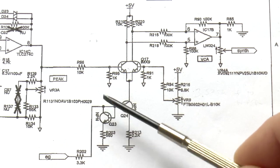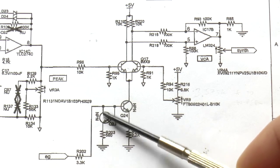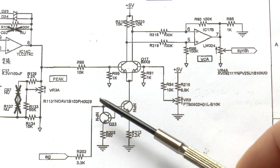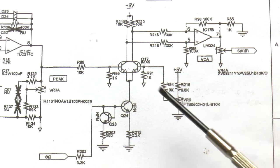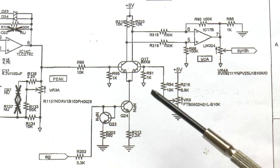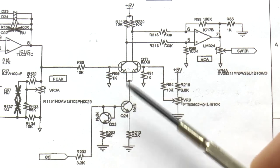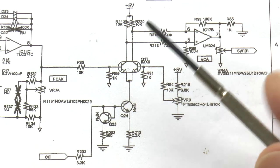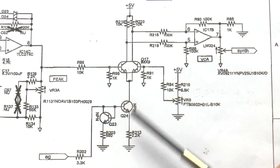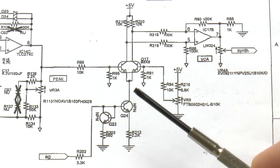So this would work for the square wave waveform of the output of the envelope generator, but unfortunately it wouldn't work for the one with the sharp attack or the one with the slow attack, because both of those waveforms have rises and falls that aren't all the way to zero, and those still produce clicks and pops. So that was a kind of complicated method that works in one circumstance but not in the other, so I kind of abandoned it.